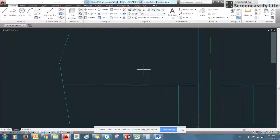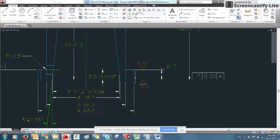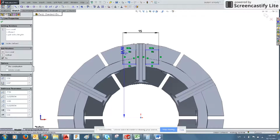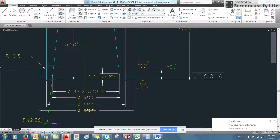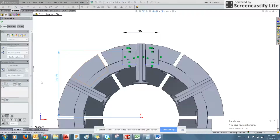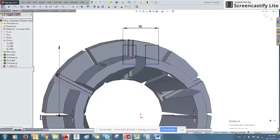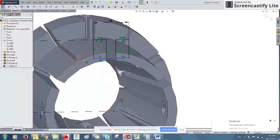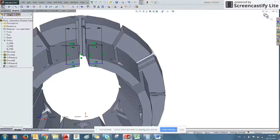Now let's make sure I'm defining the stick out correctly. So it's from the center line. All right, that means we go from the origin, and we're going to make it stick out 34 millimeters. There we go. And then as long as the back part of the feet is within the existing geometry, it doesn't matter, because once it gets extruded, it'll become part of this feature. So at this point, even though this is undefined, we can exit the sketch.